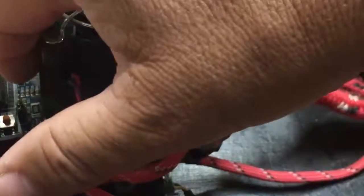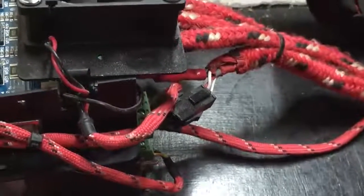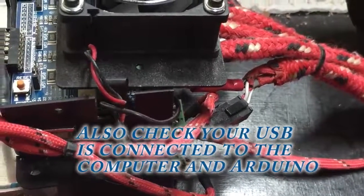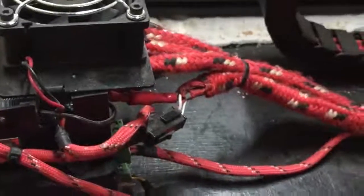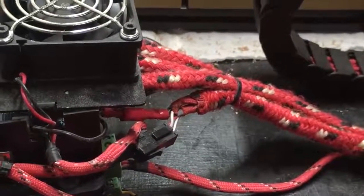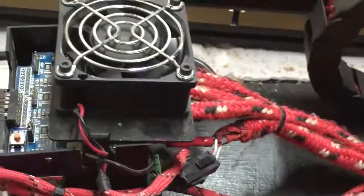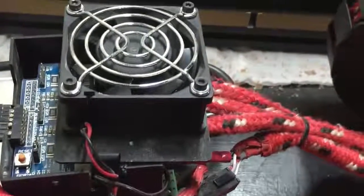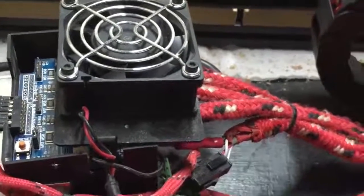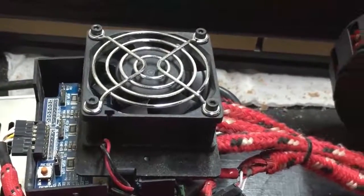Also make sure your wires are properly connected into the two-pin Phoenix plug and that there's no fraying that may be causing a short. Check your solder on your pin header — when you assembled it you had to solder the pin header, so check that solder. If it's still not working, you'll definitely have to contact the Inventables Support Team. They may have additional troubleshooting steps or may determine that you need to replace your Arduino or Grbl shield.